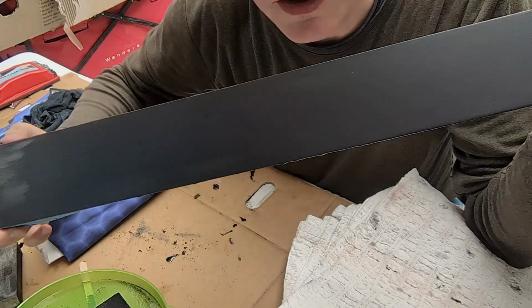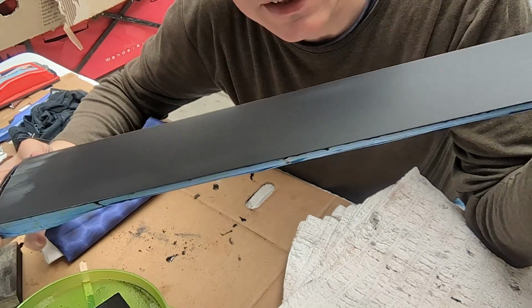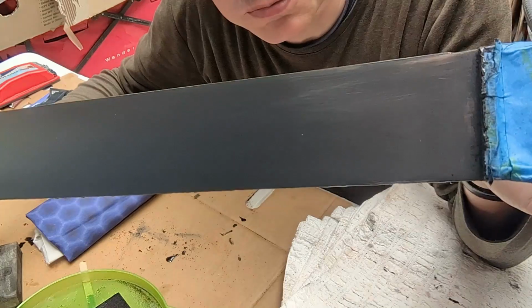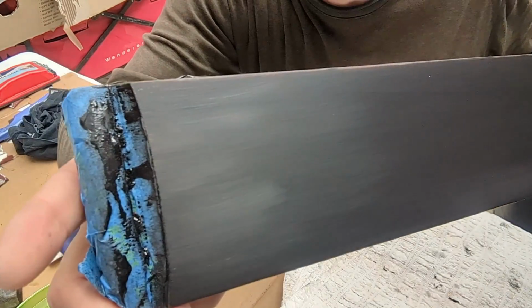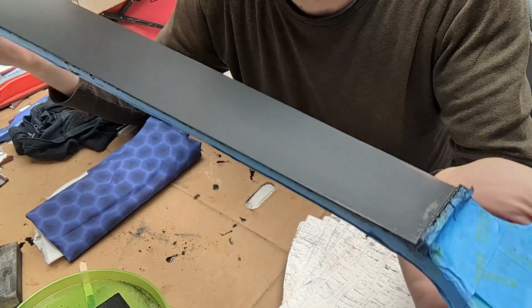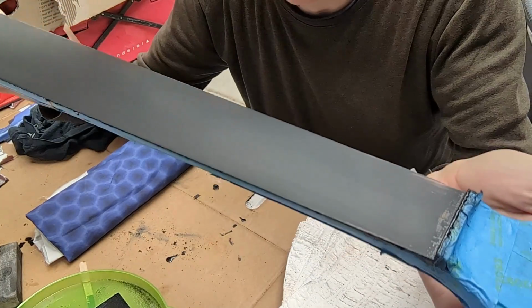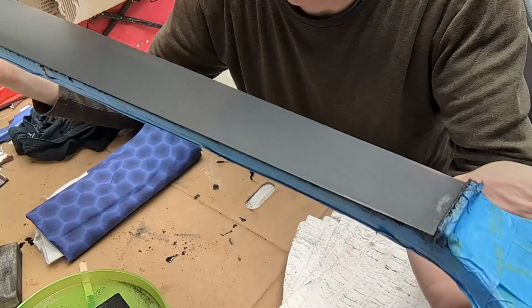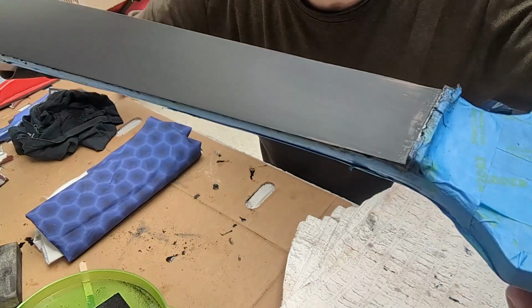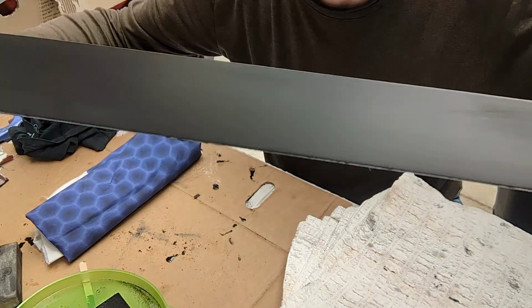This is the outcome of sanding of coat number 3. It looks already very spotless here. But I have 2 problem areas here and here, so I have to put on another coat. If I would leave it, I would sand it with very fine sandpaper, but since I'm going over with another coat, I'm going to leave it at the rough sanding.